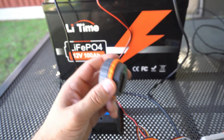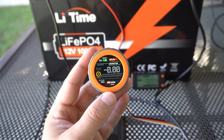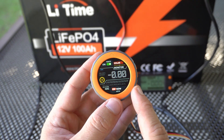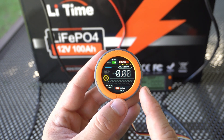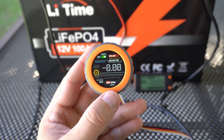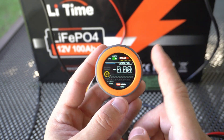So when powering your boards with an adapter, make sure it is a 5-volt adapter, not some fast-charge adapter. Some boards can handle it, but many cannot. That's why I'm now using the LilyGo board. In the second version I tried to minimize power consumption as much as I can, because ESP32 is power-hungry, and so is this sensor.